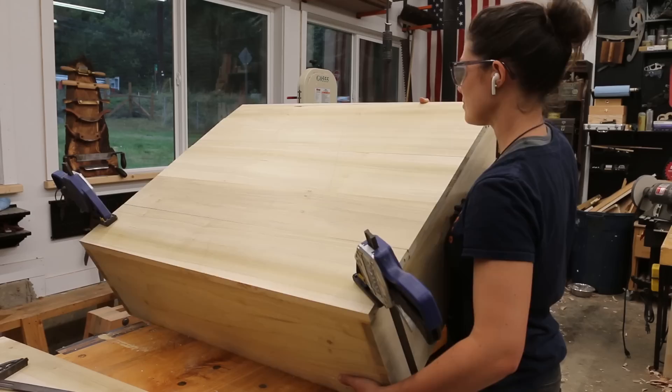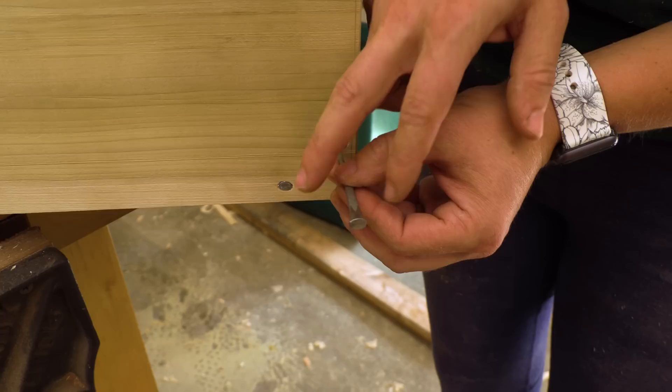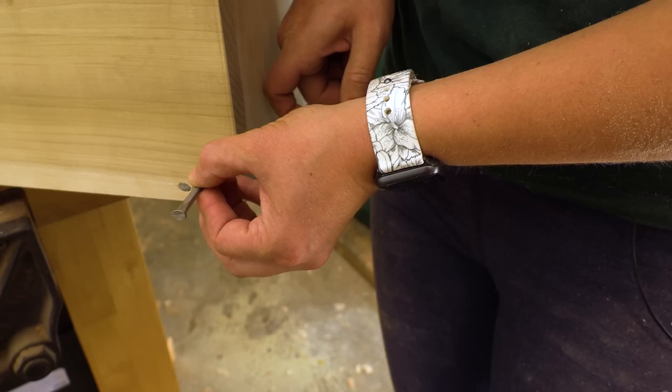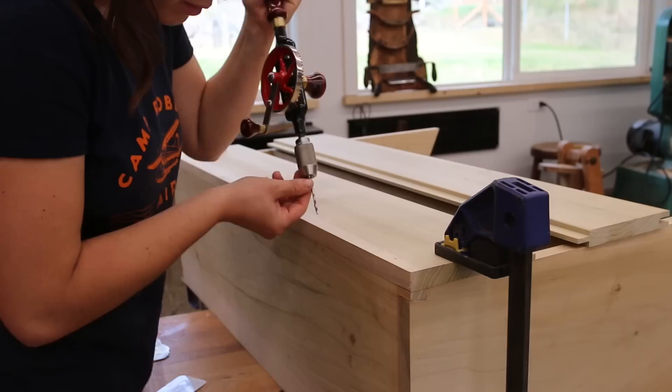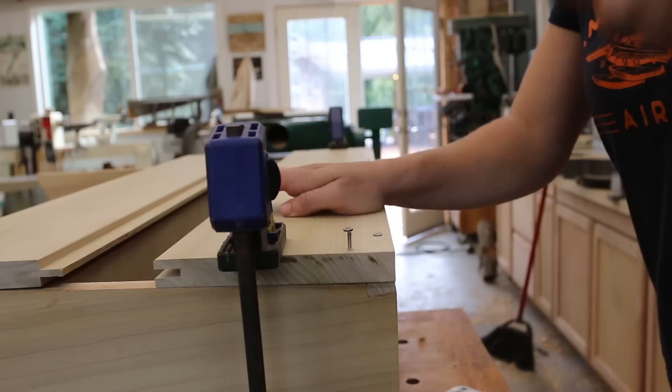A lot of people are going to wonder why I used cut nails instead of screws. The simple truth is because it was traditional, but they also create a little form of joinery on their own. We want to put the cut nails in such a way that the thicker part of the nail — it's thinner on one side and thicker on the other — always goes with the grain direction, and it actually wedges into the board you're attaching it to. If you were to go the other way, you would have a very high likelihood of splitting because the grain is weakest that way and this would wedge it apart. So we put it in this way and drive it in so that it's going to wedge the opposing board and hold it nice and tight.